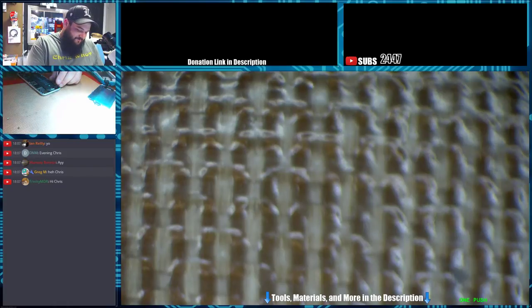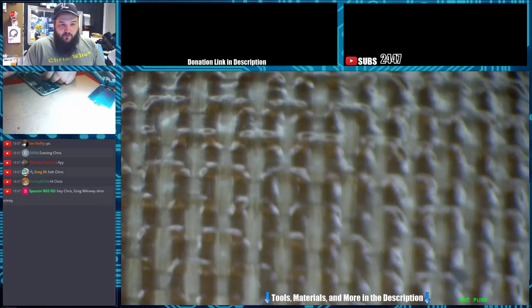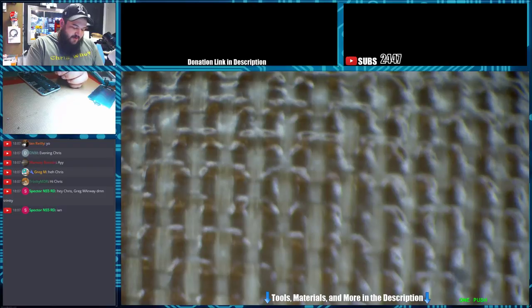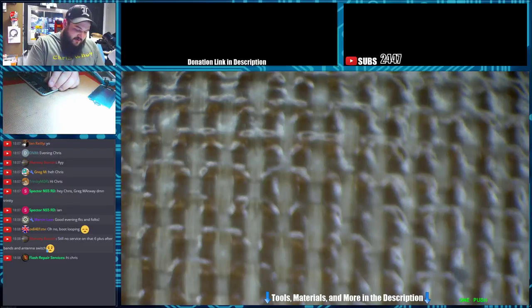What's up, Trinity? Alright, so I'm finishing up an iPhone right now. I'll talk about this one a little bit so you have an idea of what to look for if you run into this problem. This was an iPhone 6 that had no microphones at all, top or bottom. Siri couldn't hear you, and on phone calls people couldn't hear you. The solution was that the audio IC seemed to have physical damage, which was keeping the solder balls from making connection. A quick reflow actually fixed that.